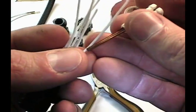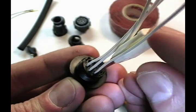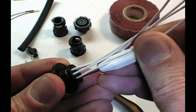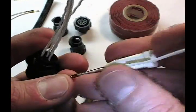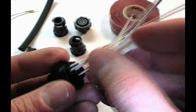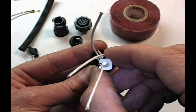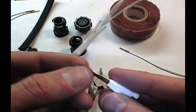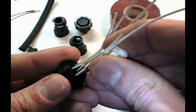The way we pull a pin out is with this extraction tool. We take the tool and slide it over the wire, then slide the tool down into the connector body. Insert it until it bottoms out and clicks, then pull on the wire and pin extractor together, and it will pull the pin out. If you run into a stubborn pin, try inserting the extractor at a different angle — choose different clock positions, rotating 90 degrees each time. Sometimes these wear and a certain position may not release as cleanly.